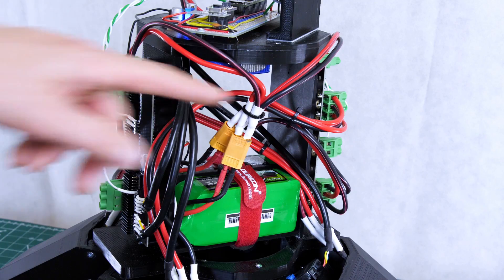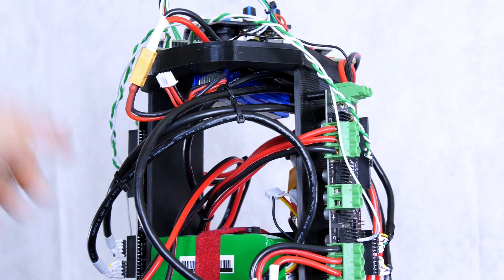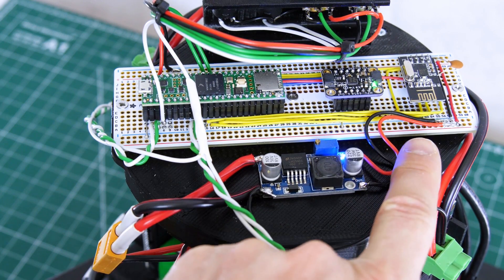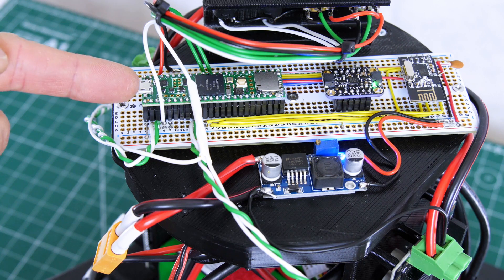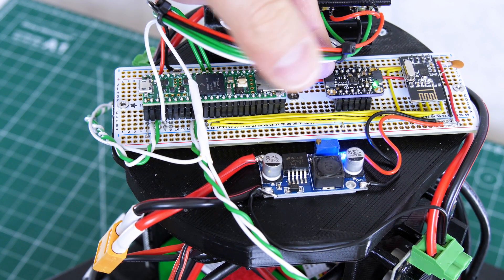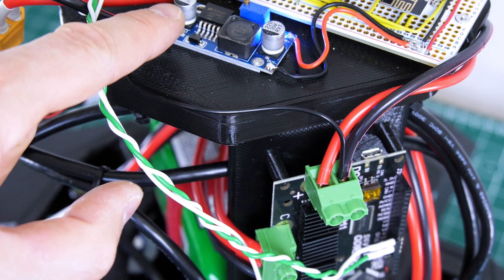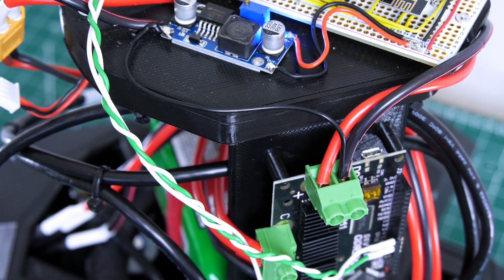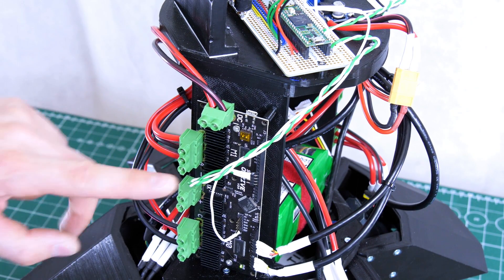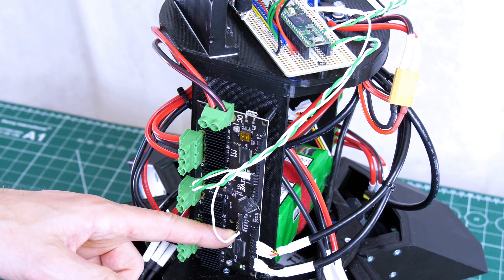We're all wired in. The two main batteries are wired in series, feeding both O-drives at 24 volts. Underneath this platform is another battery — an 11.1 volt LiPo — which feeds a separate regulator to power the electronics. I'm using an adjustable regulator set to 5 volts that goes to my perma-proto board and powers everything. There's a 3.3V regulator on board the Teensy powering the NRF24L01, which is a 3.3 volt device. The MPU 6050, despite being a 3.3 volt device, has its own regulator on board so it's wired to 5 volts. I also have a common ground wire connecting the regulator ground, battery ground, and all electronics grounds into the O-drive ground — giving us common ground throughout the system. That means we just have RX and TX wires going down to the O-drive for serial comms, and there's also a ground wire to the reset pin to reset both O-drives and cut the motors off — a bit like an emergency stop. Not having multiple ground connections avoids ground loops, which would make a big loop antenna with the ground wires and pick up lots of nasty radio noise.